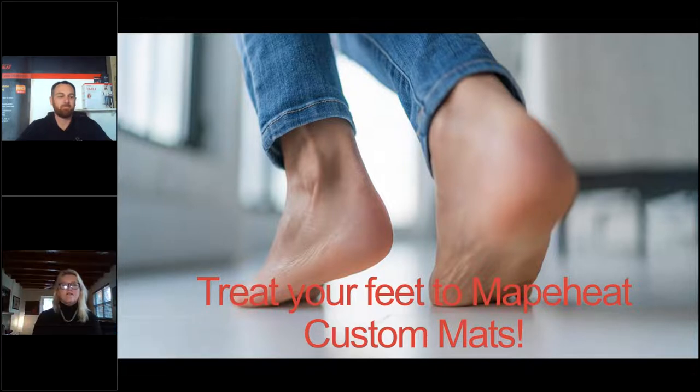Let's see. Here's one question. Can you put Mapeheat under a bed and furniture areas? Yes, Sonia, I'll jump in here. The best way to think about this is you really don't want to pay for a product you're never going to use. So typically you're not going to heat under a fixed piece of furniture, like a vanity, where it's going to be screwed to the back stud of the wall and it's never going to move, so therefore you're not going to have floor heat underneath of it.